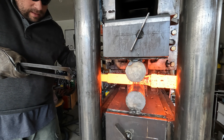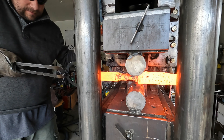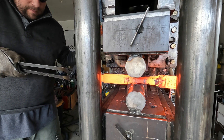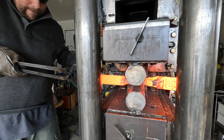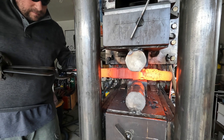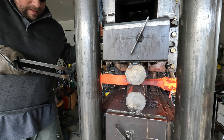Here I am getting it up to heat and forging it out. I'm retaining that splined handle - I want that splined handle to be part of the grip. I'll be making a little grip extension out of some tubing later, and a pommel out of aluminum. I'm drawing out the blade to about 5/16 inch thick, just because of the imperfections of the drawing process.